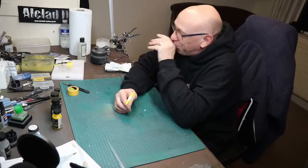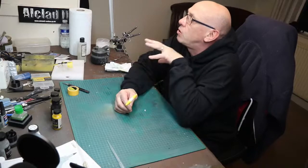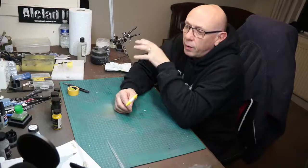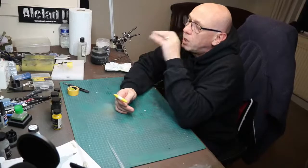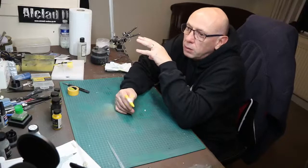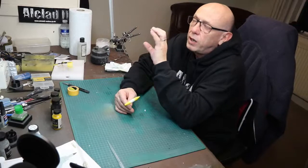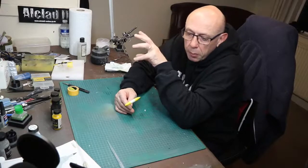It's what makes the color up, the pigments. They are the metallic flakes you see. We don't use flakes, we use powders. So they are very, very fine, hence they don't need the ball bearings. Because of the makeup of mil specs, the mil spec pigments are quite a lot bigger. Although still very tiny, when they stand for a while, they will settle at the bottom, and it needs a ball bearing to mix that up.